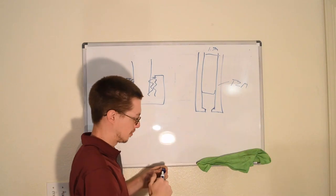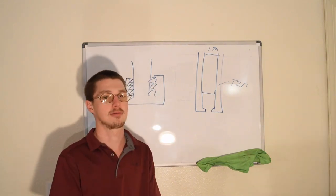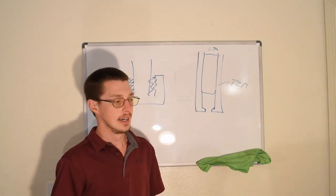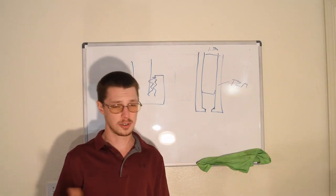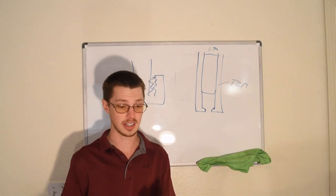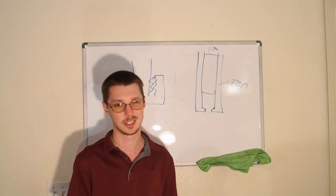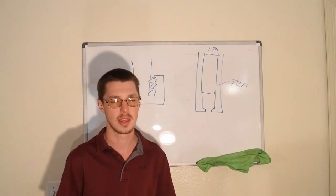That's essentially what we're trying to do, just hold the viscoplastic material in a confined space for long enough that it will extrude through the hole and nowhere else. And so that's pretty much what we've been up to, is getting material, learning about how it works, and essentially implementing it, turning it down on the lathe, figuring out how we're going to design the shaft, and figuring out how to most easily integrate it with the existing off-the-shelf motor that we've been working with, the Zing 2203s.